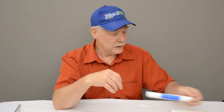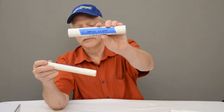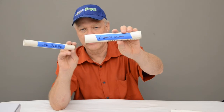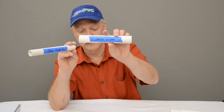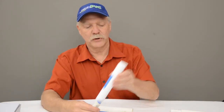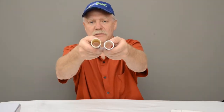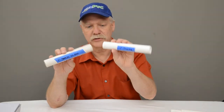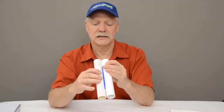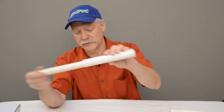Next, this is one-inch CL 200, and any of the three-quarter inch will go into it — schedule 40, schedule 80, CL 200, doesn't matter. You start with CL 200 or thin wall furniture grade because these two are almost identical in outside diameter. So schedule 40 goes into the thin wall furniture grade, and furniture grade goes into the CL 200.